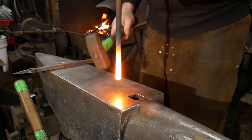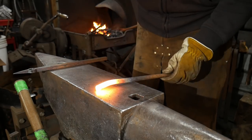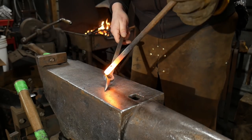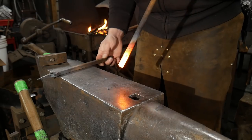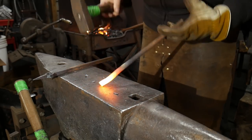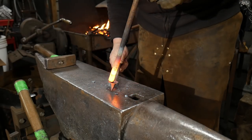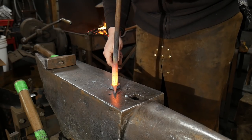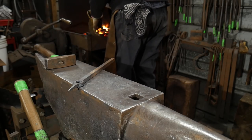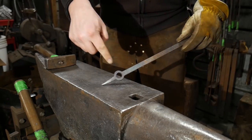I've got a piece of half-inch rod here — or 12.5 mil — and it is too small to fit through that hole, which is about 5/8 inch in diameter, roughly 16 mil. So what we're going to do is upset the end of this bar. It's going to go squirrely on you — that's okay — until it just fits in here and starts making a fairly snug fit. We don't want it too snug yet. I'm going to go ahead and heat this up one more time and go again.